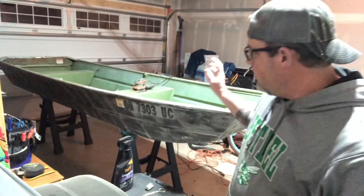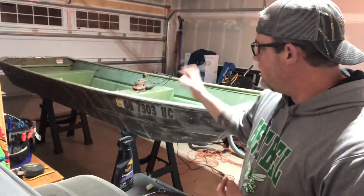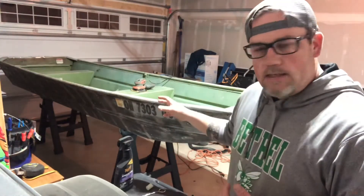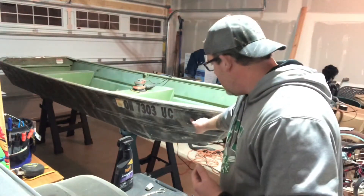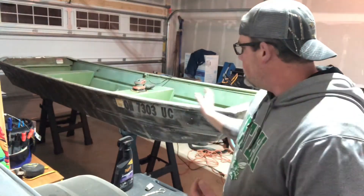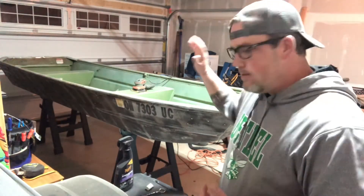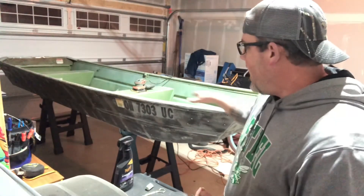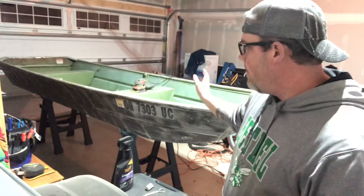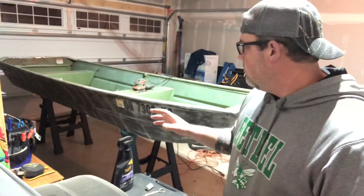For part three, I'm not going to do another video on sanding — I'll work on that over the next week or so to get this thing sanded down. Then I'm going to check for leaks: if a rivet's leaking, I'll mark it and replace it, just to make sure it's all sealed up before I start to frame the deck. I'll probably prime and paint the inside before I put a deck on, just to make sure it's solid and done right.